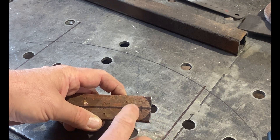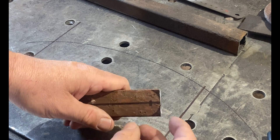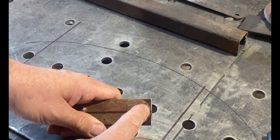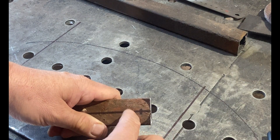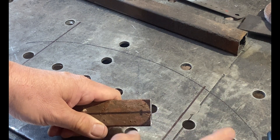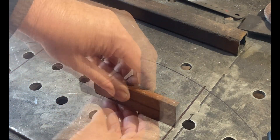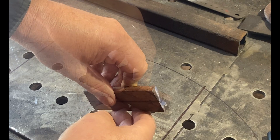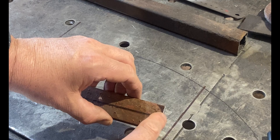It's not a big deal that we're only going to have about 2 millimeters at the end here, because this is welded onto our motor shaft through this location anyway. The pressure points for this — it's not pulling in the horizontal, it just has to go in the vertical. So not a big deal, just keep that in mind. Make sure you get that 10 millimeter distance for that mark off the edge.